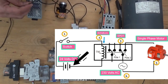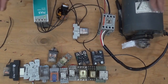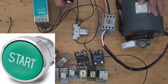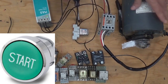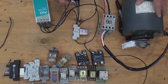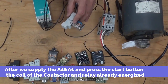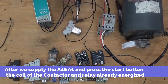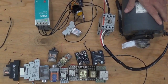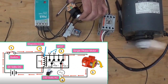From A2 of our magnetic contactor coil, going back to the negative of our power supply. In this scenario, I didn't plug in the motor yet, but I already connected the power circuit of the motor. When I press this switch, the contactor should energize. Let's try — both the relay and the contactor energize. Now I've plugged in the motor. Let's try if it works. It works!